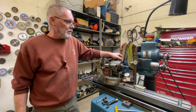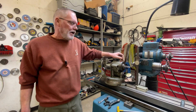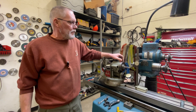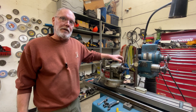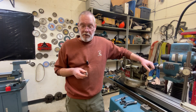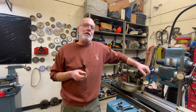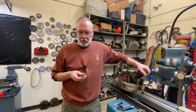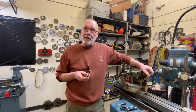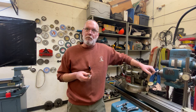I fully believe that a radial relief alone would be just fine for sharpening a tap. I think this is sort of a little bit of icing on the cake. I don't feel it's necessary. It is a pretty common standard thing, so it certainly can't hurt, but the real thing that's going to make a tap cut is the radial relief, not the axial relief. Progressive reliefs are much more common on a tap — I've never actually seen a factory ground tap that had an angular relief. Having said that, I can't think of any reason it wouldn't work with an angular relief. I think you'd have a less durable cutting edge with an angular relief, but at the end of the day if you have relief and you have rake, you're going to cut. I think it would work either way.